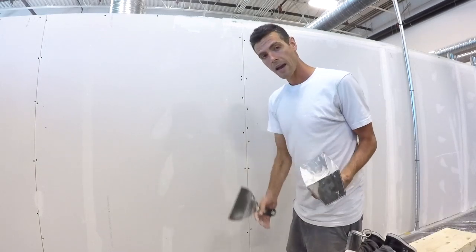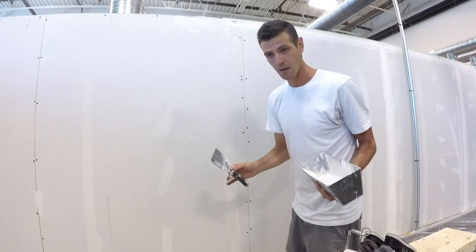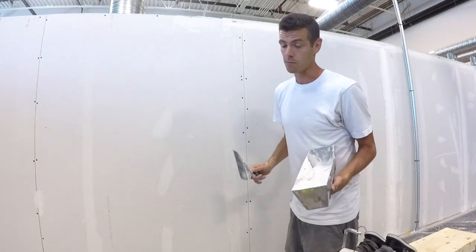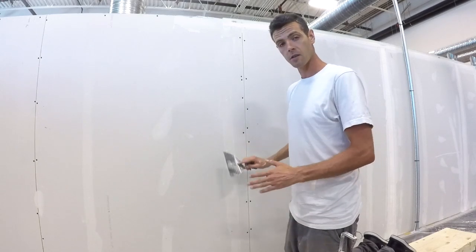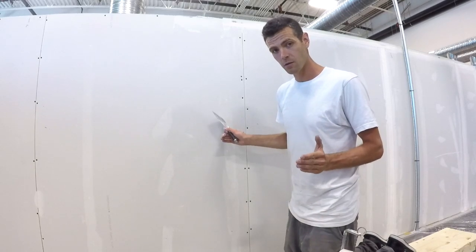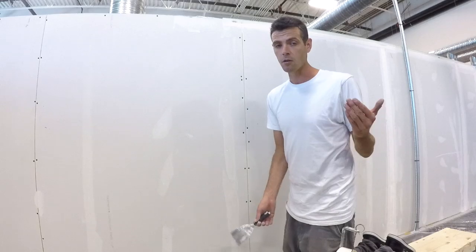Anyways, that's how you coat a screw. Screws need a minimum of two coats. Right now I'm using all-purpose mud — that's another thing that's really important to note. You want to use an all-purpose or a taping mud, or if you're going to use a quick set and it's a brand that doesn't have good adhesion, you might want to add a bit of glue. Ideally I like to use taping or all-purpose to coat my screws. Second coat can be with a finish mud because you've already bonded to the screw head really well. Just lay it on, take it all off really thin. Ideally you should do it two more times to guarantee that all of your screws are flush. You can also use thicker mud — don't use runny mud because it shrinks more, and that way you'll for sure have to do three coats. Standard practice is three coats for most people. Let me know in the comments how many coats it takes you to fill screws.